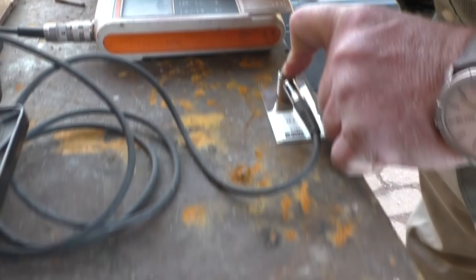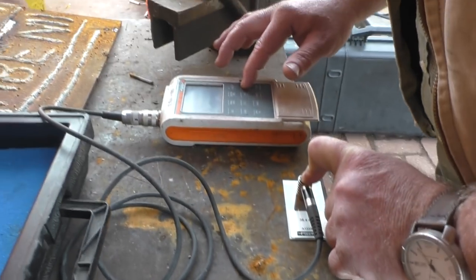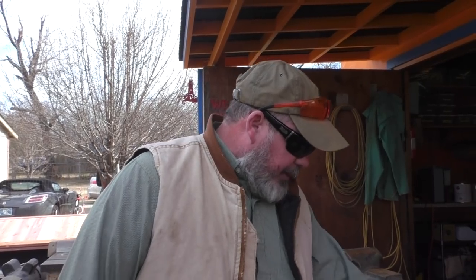We better find the truth because it's easier to paint here than it is in the oceans. First thing we do: calibrate the equipment. So for calibration, you have these little known standards — thicknesses of plastic at various thicknesses. We've set up for the middle one. The middle one's 38.4 mils. So you start off by calibrating to something in the right range so it's more accurate.